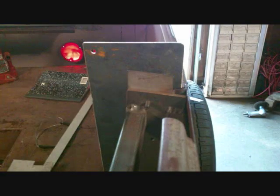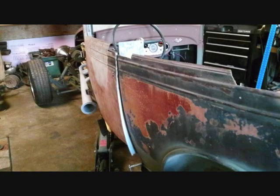This hole for the striker latch is about half an inch off. Not too shabby — I shouldn't have wasted it, but I wanted something. It was Friday and I wanted to get some kind of shape cut. I'm glad I did because down at the bottom I need to actually kick it out to the left an inch. I gotta kick the bottom out about an inch and that'll take care of that little gap, and then I can start working on the bottom.